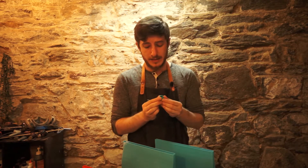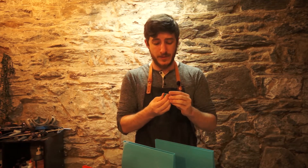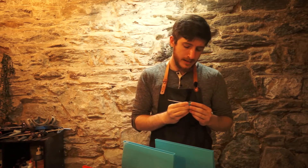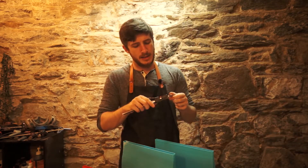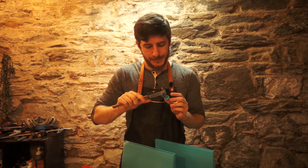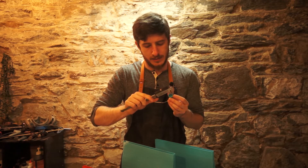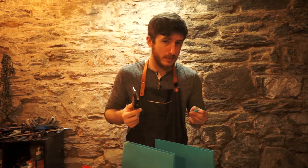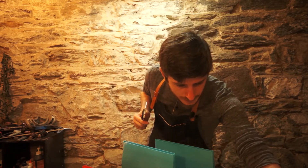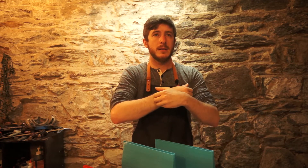We came across this calibration cube, and it looks good — consistent layer height, a wall that is very firm and strong. Let's double-check the wall thickness. There are places where it's 1.78mm; it's supposed to be a two millimeter thick wall. That's why the inner and outer walls weren't meeting together.